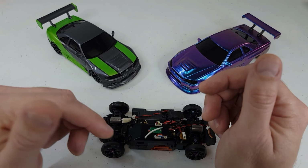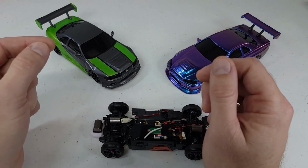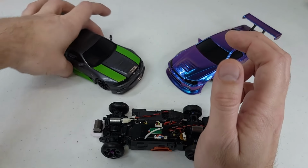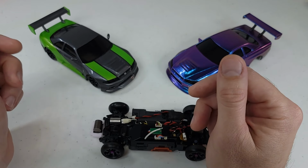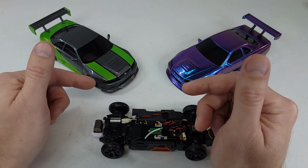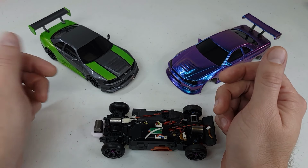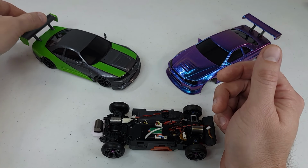So I tried that out first, and eventually I just wiped it off with alcohol. If you want to remove any paint without destroying the plastic, especially clear plastic, which is really easy to destroy if you use the wrong chemicals, be careful. If you use something with acetone in it, it'll eat the clear plastic, fog it up and make it look like crap. So just use 91% alcohol, probably even 70% would work fine too. I used 91% alcohol and just wiped it away, and it would eventually wipe away clean, looking the way it did from the factory, without anyone knowing I even tried to do anything to it. Same with the white plastic. If you want to redo it, you can just use alcohol to remove any of the paint, and it won't really hurt the plastic, and you can just start over again.